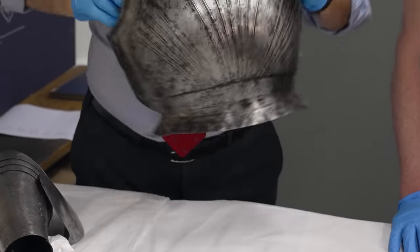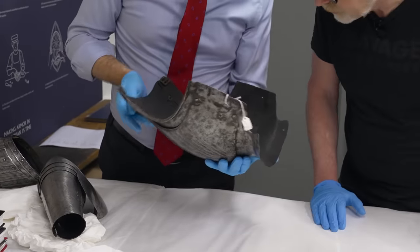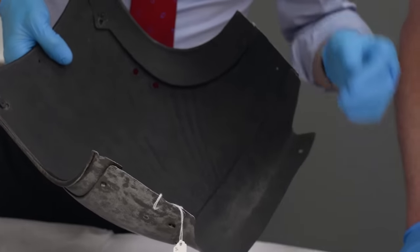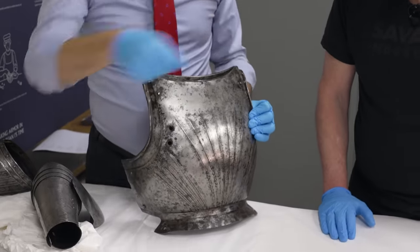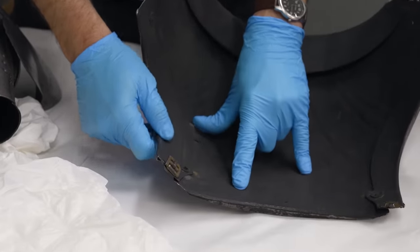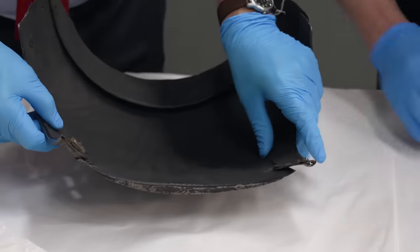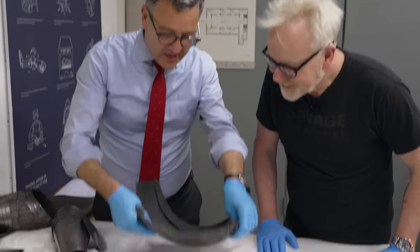This is a torso defence — it's got a flexible waist. That's pivoted with just two rivets, one here and one there, and that's enough to create this kind of flex. When you use your arms in combat, you need to be able to reach over your torso. So here they use what we call sliding rivets — these pieces have a little slit and they can move in and out, so it can contract and expand. On the best armors, there are springs that push them back automatically, so as soon as you're done, it comes back into place.